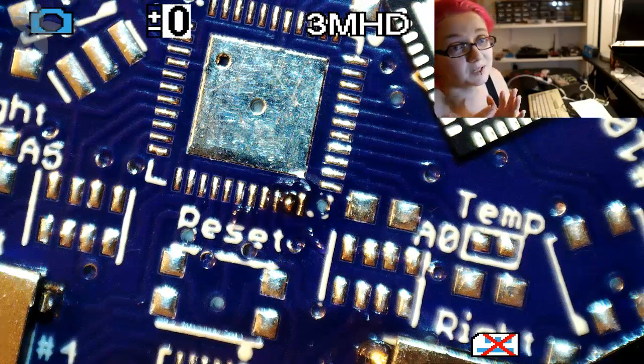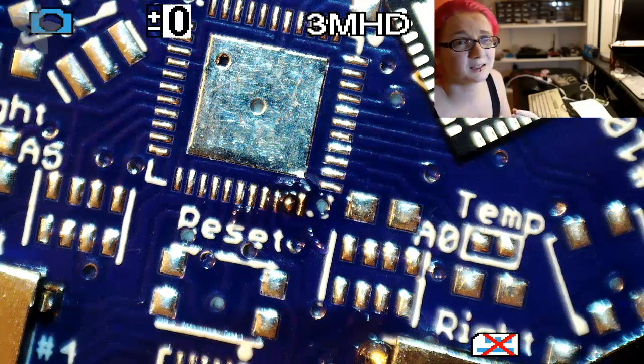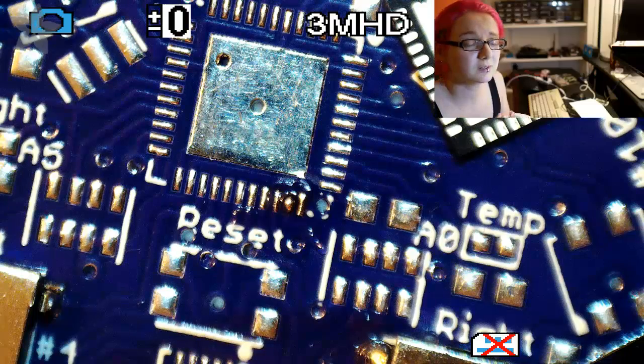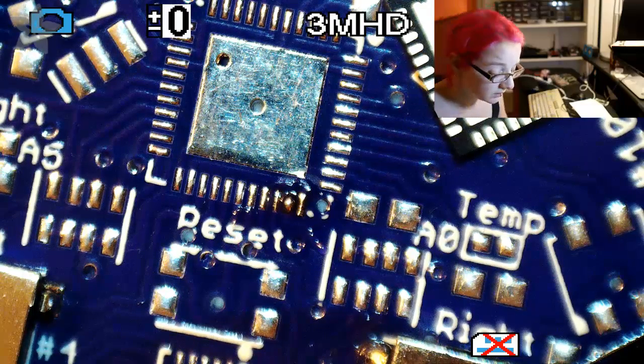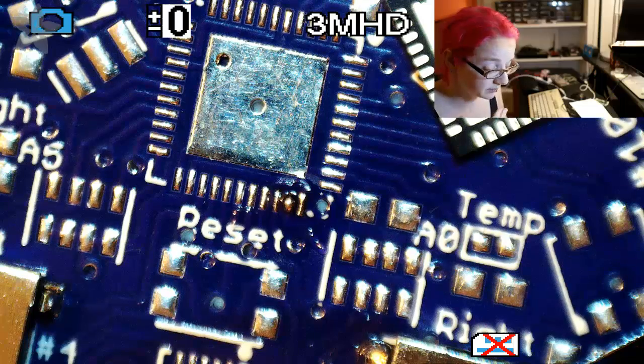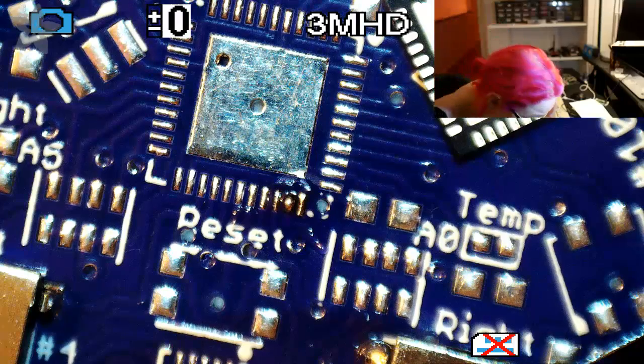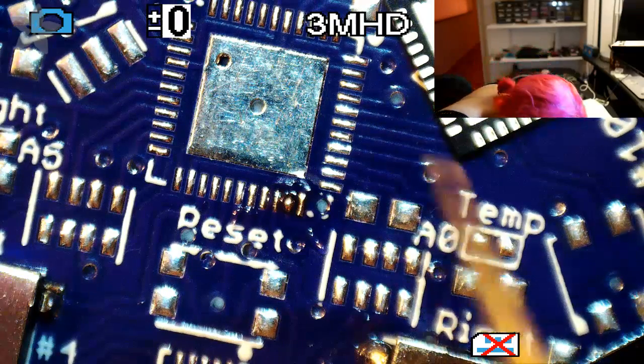But since it's a prototype, and again, I know I'm not passing that much current through it, it's going to be sourcing maybe like 220 milliamps total. It drives like 2 LEDs that are low current. It doesn't power anything. All the GPIOs are basic GPIOs. So for a prototype, I think it's okay.